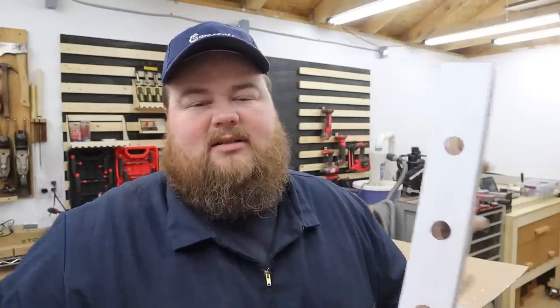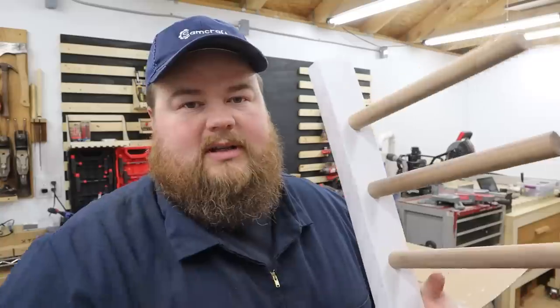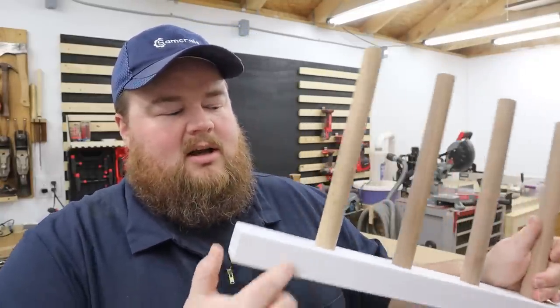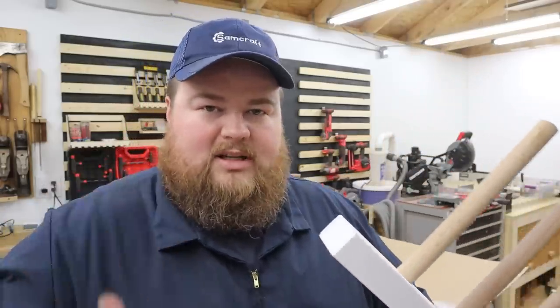Try as I might with sealants, protectants, and paints, water will make its way into the joints. My thought process is, if this goes all the way through the 2x3, the water can go through and eventually go on out the bottom. It's not going to reach the bottom of that pocket, sit, and rot everything out.